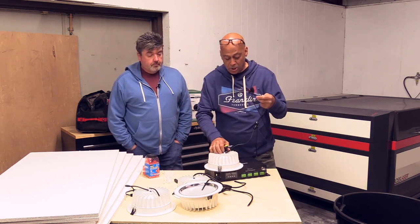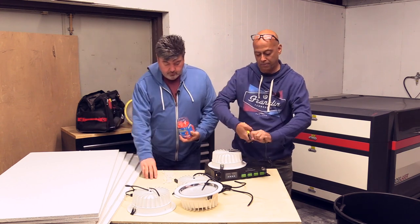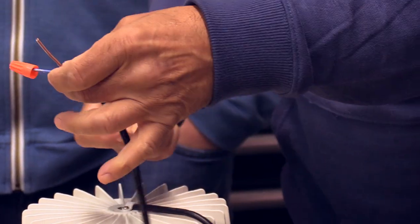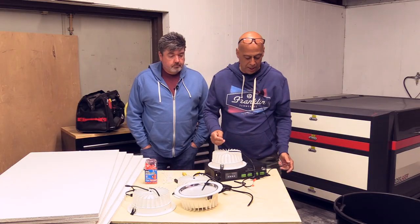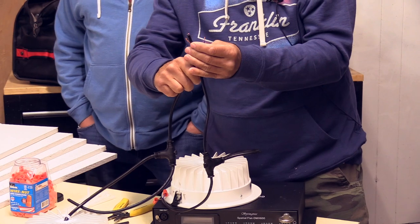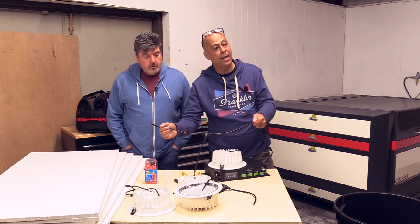All right, so let's start with this, our last light in the chain. We strip both sides. Go ahead and open the wire nuts for me, Jade. Get me two orange wire nuts in there. I like to do this on the last one, just so this doesn't butt up to a metal T-bar in your drop ceiling and nothing happens. Completely isolates. Now you'll notice that there is a built-in T in these. I can wire up all my lights together like this and it will work, but it will overload the driver eventually. So please, power in, power out, connects it, and continues on.